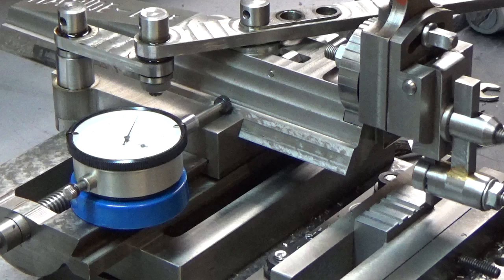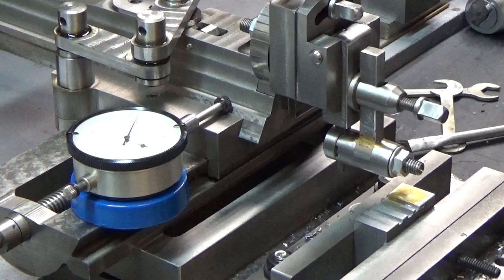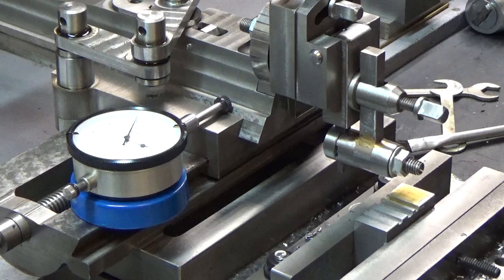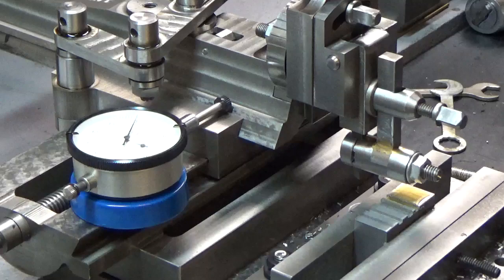So anyway, I'm going to go ahead and put a little oil on the work and proceed to cut. I'm only going to go down about a thousandth per pass — not very much. Cutting a slot is actually a nice chore for the handshaper. What I'd like to do eventually, if I can get this tool bit cutting right, is to develop a situation where I can cut an internal slot. But at this point I'm going to go down about fifty thousandths and we'll see what happens.